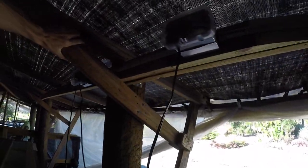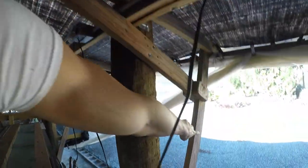The next rafter is the strong one. Again, the same construction. I don't have to go over this again and again. One, two, three, four screws. Two screws attach this to this member, to that member. This member is attached to the piling, of course. This reinforcing member is attached to the rafter and to the 2x4 that holds up the overhang, in the same fashion.